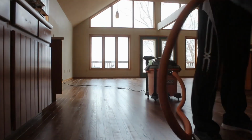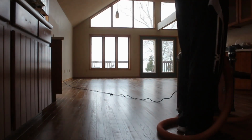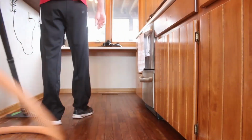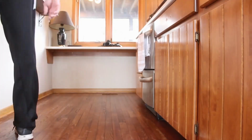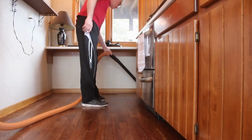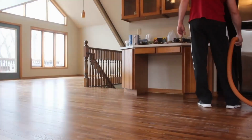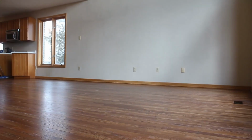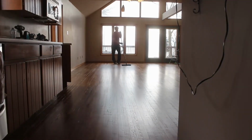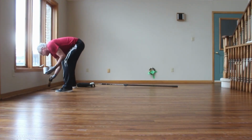And now we thoroughly vacuum, of course, because you leave that little residual film after you screen it. Everything's thoroughly vacuumed, and then I go to the Swiffering. I always Swiffer twice. You don't see it in the video here, but I'll Swiffer the floor, then vacuum my Swiffer, and Swiffer again. For the amount of time it takes, it's well worth it, because of that residual film, so I like to Swiffer it.